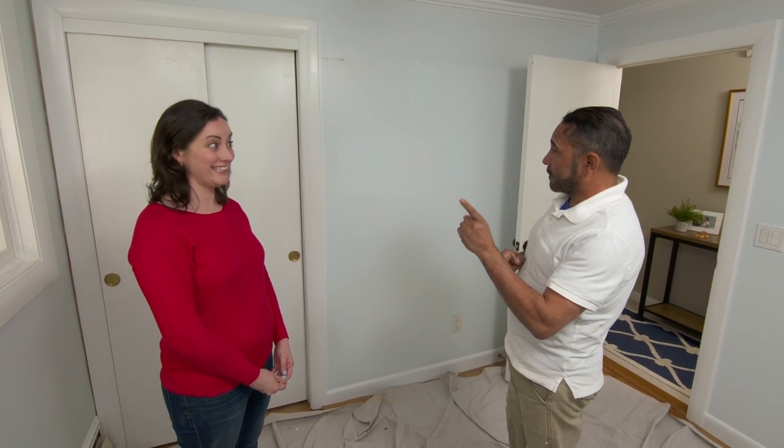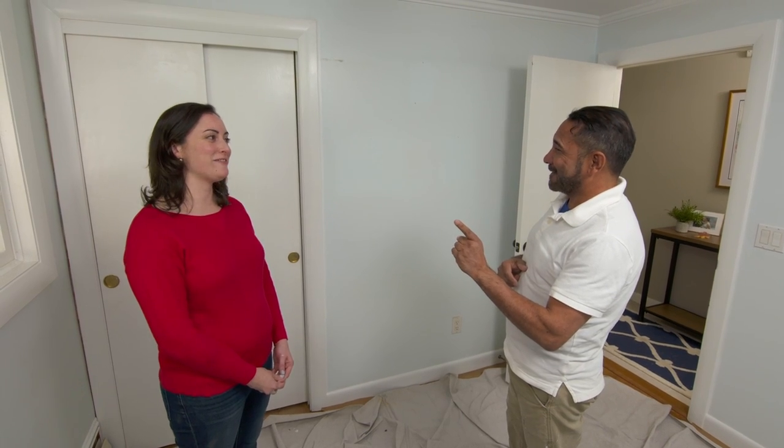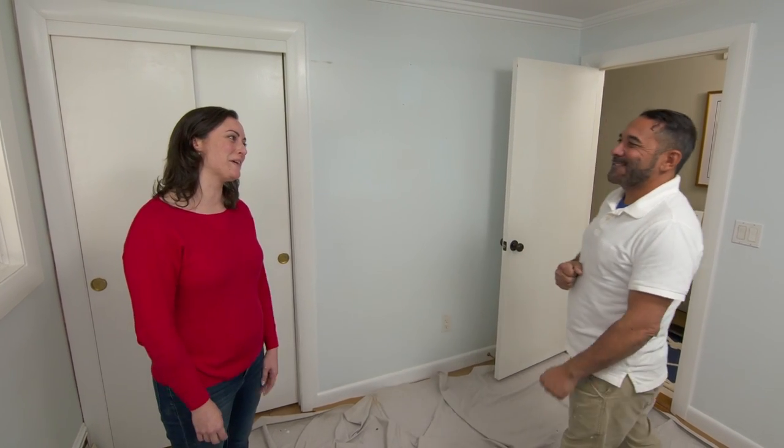Before you paint the walls, make sure you fill in all the nail holes, lightly sand with 220-grit, clean the walls, and you'll be ready to go. Send me a picture when it's all done!